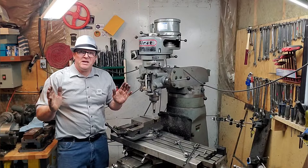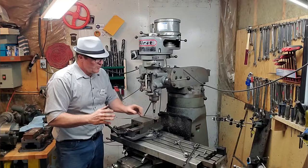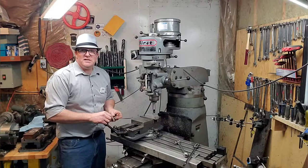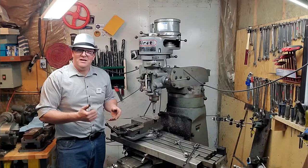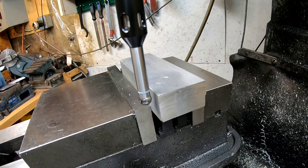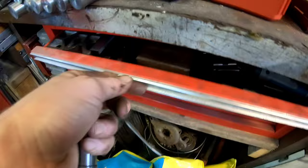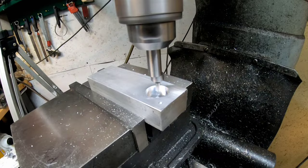Because it's sticking so far out, it can be off by as much as 10 thou. If we twist it back and forth we could get a lot closer, but really this is within two thou and the paper method is probably within two or three thou as well. So this doesn't work for me given the extra expense plus needing another collet. Under the right conditions it would be very accurate and it's super fun to use, but I'm going to stick this back in the box and let it collect dust for a few more years.